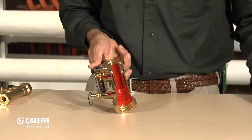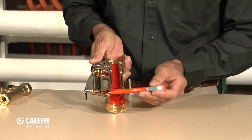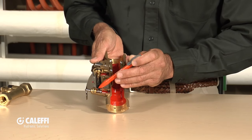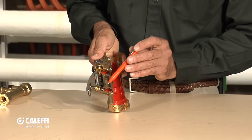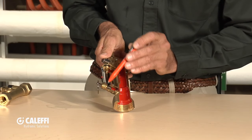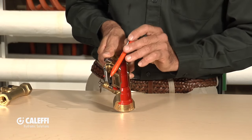Jumping inside here, this is what a cutaway looks like. The fluid goes through the center of this valve, and when you pull that little pin out, it diverts a bit of the flow up through there and moves a little piston in the chamber up and down. Notice what happens when the piston moves up and down — it's sliding a little ball in the window. This little piston has a magnet on it, and that ball is a steel ball, so as the piston moves up and down, it moves the ball in the window with the magnet.